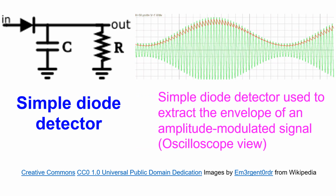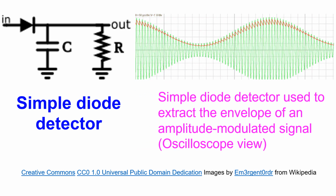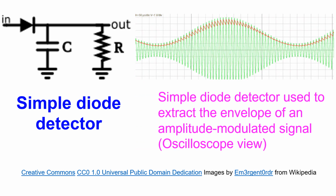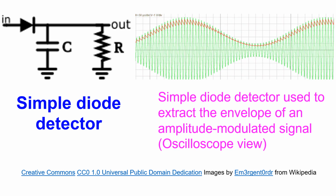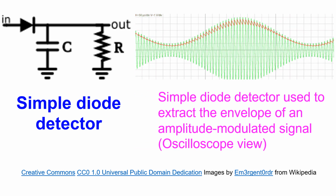Carrier and the other sideband are removed. The sideband transmitted can be either the lower sideband, as in frequencies below 10 MHz, or the upper sideband for higher frequencies.